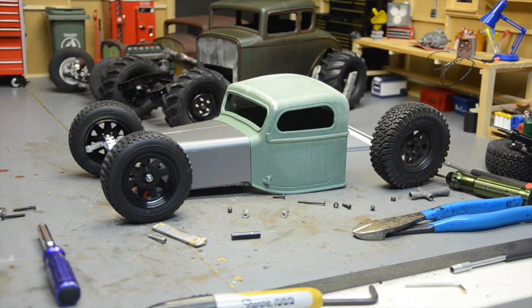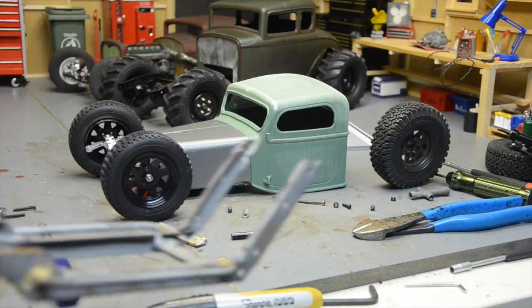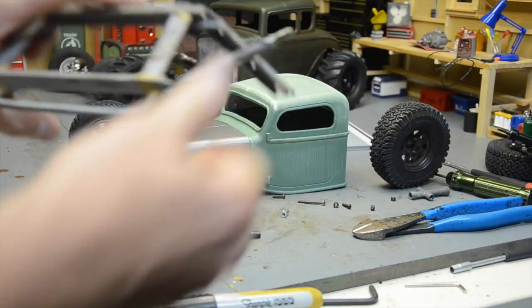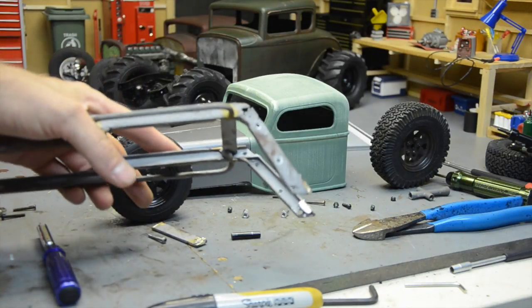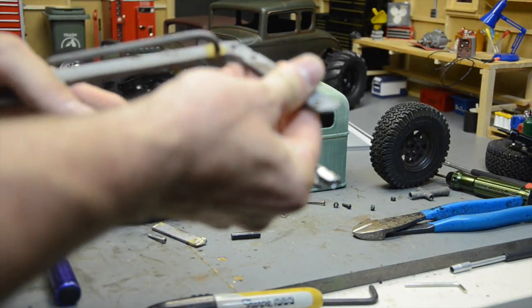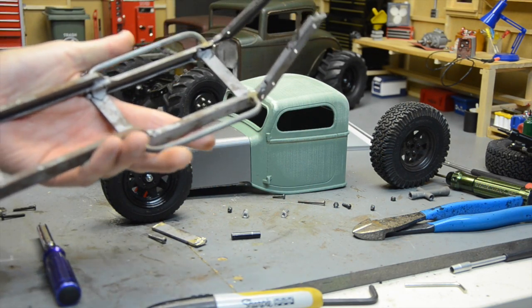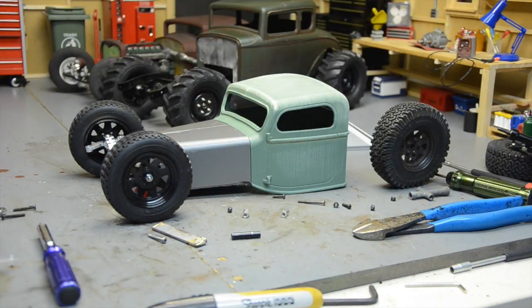Oops, alright, that didn't go as planned. That chassis was welded with my stick welder, and it didn't survive the cutting. This side over here broke. It's not the weld; where I drilled the hole for the suspension mount to start with weakened it severely. The weld's still holding, but the metal itself wasn't strong enough, and it ended up bending, and the whole thing got out of whack, so it is scrap, I'm afraid. Frustrating, but with disaster comes creation, I guess.